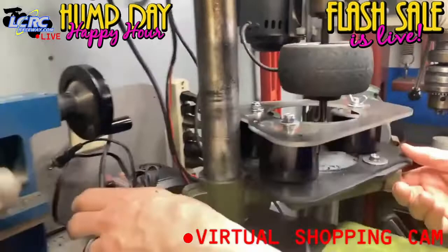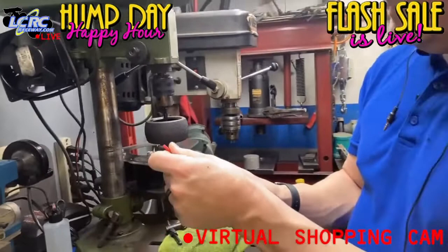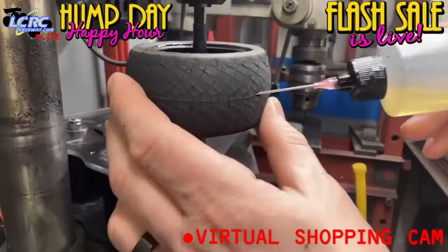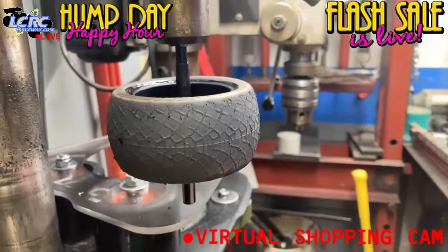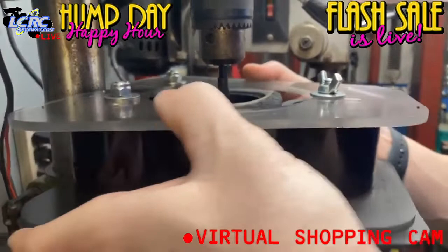So before we do that, we're going to use the needle oiler — we'll actually have these for sale next week as a package deal. I take the liquid wrench with the needle and poke it through the foam so I'm in between the wheel and the foam, give it a little squeeze, come around to the other side and do the same thing. How much do you put in? I give it a pretty good little squeeze. Walk it around a little bit, then wiggle your foam roller up on there. I keep mine fairly tight.